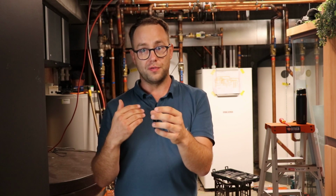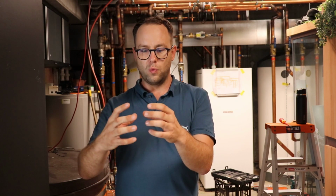So what that means is when you bring the water up and you want to either strip energy from it or dump energy into it, the quality of the water affects all of the pipes and the pumps and the parts on the way. Here, there's actually iron oxide bacteria in the groundwater. When that comes up and is in contact with the air, it starts multiplying and creates this orangey brown sludge, which ends up filling up the pipes and the heat exchanger, meaning that the flow rates are reduced and a lot of maintenance is required. So for this project, ideally, they should have used a closed loop system. It would be a bit more expensive, but zero maintenance, and they wouldn't have this issue.